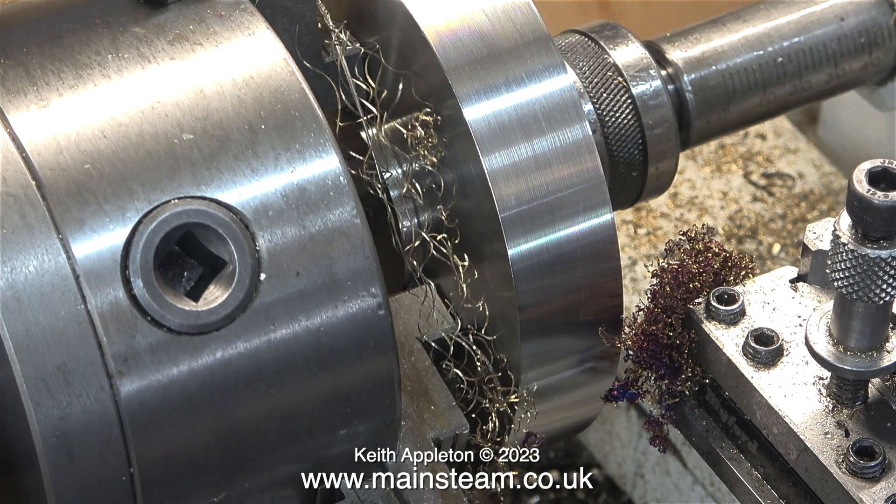This particular tip has done a lot of work, and it's always been used cutting from right to left. So it seemed a good idea, once I'd cut from right to left for the last time, to try a final cut from left to right — and this gave a very good finish. Please be aware though that in order to cut from left to right, the work needs to be supported, otherwise you can pull the work out of the chuck. But in this case, the live centre stops that from happening, and I was very pleased with the finish I got.